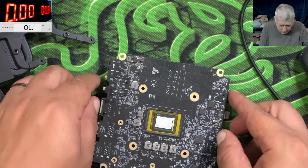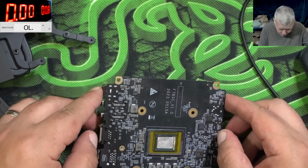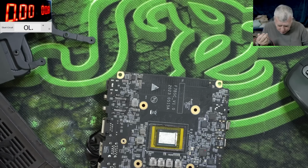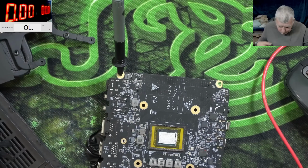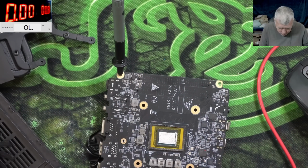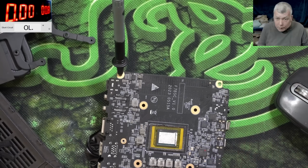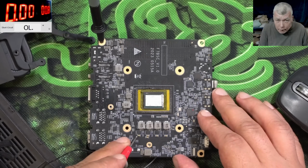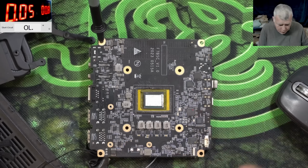Good, so we are at the point of... Okay, let's use... yeah, so we have to come with some current. The problem is where we are coming with the current on this side of the board. And what I'm thinking is actually coming with the current on the main power rail, of course. Like these capacitors. Yeah, 0 ohms. So here is the main power rail on this capacitor, yeah? Here we have 0.4 volts and here we have 0.8. So here is the plus.